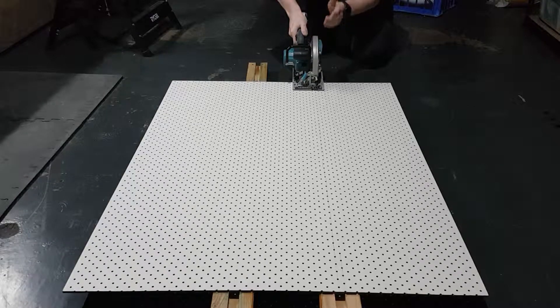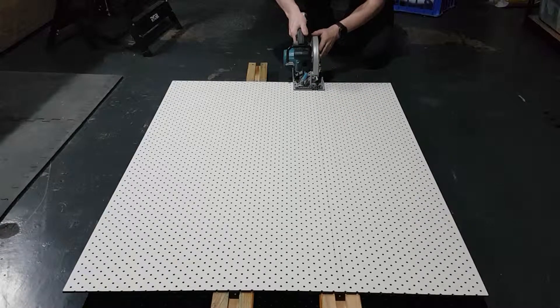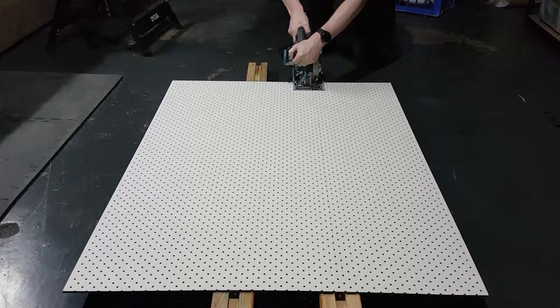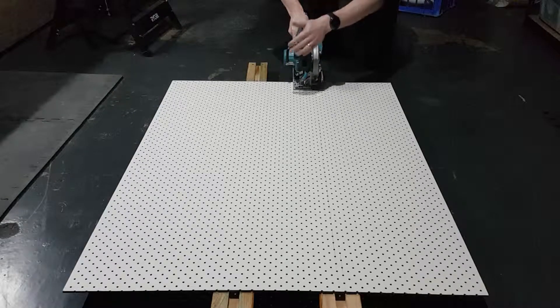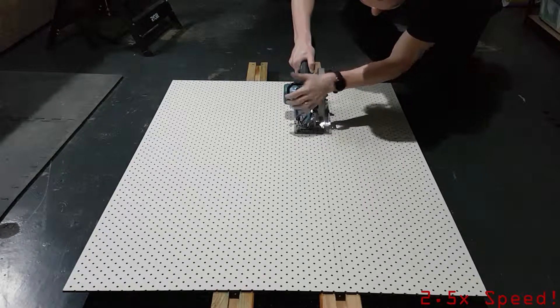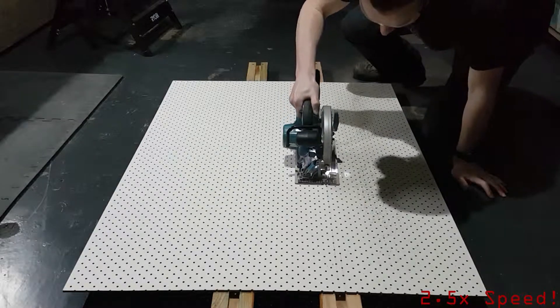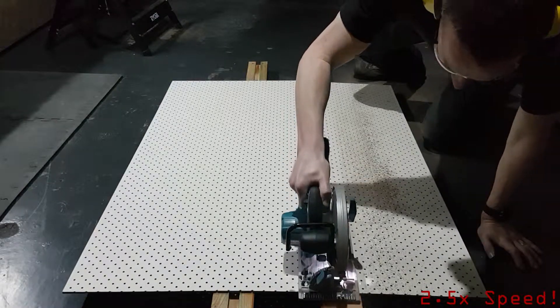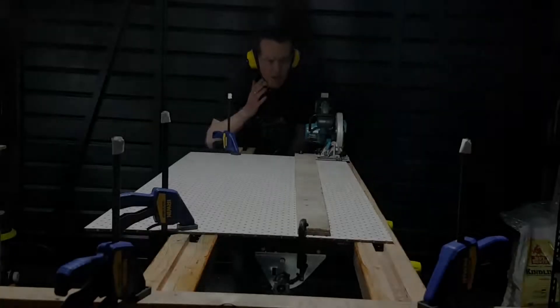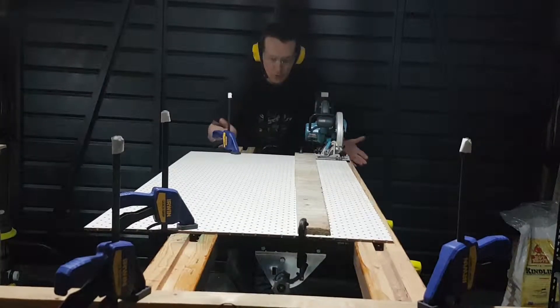I knew these long boards were coming in handy. This cut doesn't need to be anywhere near accurate because I'm actually cutting it a bit proud — I've left extra space to trim off further down the line. This is just to get rid of the dead wood I don't need. No guides set up — I've literally just scribbled a line all the way down the board. Blade set very, very shallow — it's 5mm MDF — and we carefully proceed to cut straight up. And for once today, something actually worked how I thought it would. That's nice.